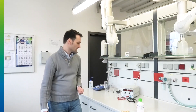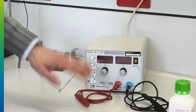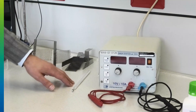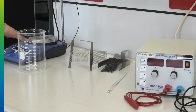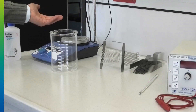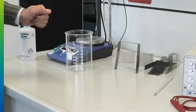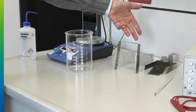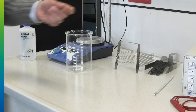The equipment, of course. We need a standard rectifier, cables to get a connection, and a thermometer to check the temperature — you need 45 degrees. A hot plate to reach 45 degrees if you need to heat up depending on your climate and room temperature — ideally one with temperature control. And a pair of anodes: either platinized titanium, or mixed metal oxide anodes work as well.